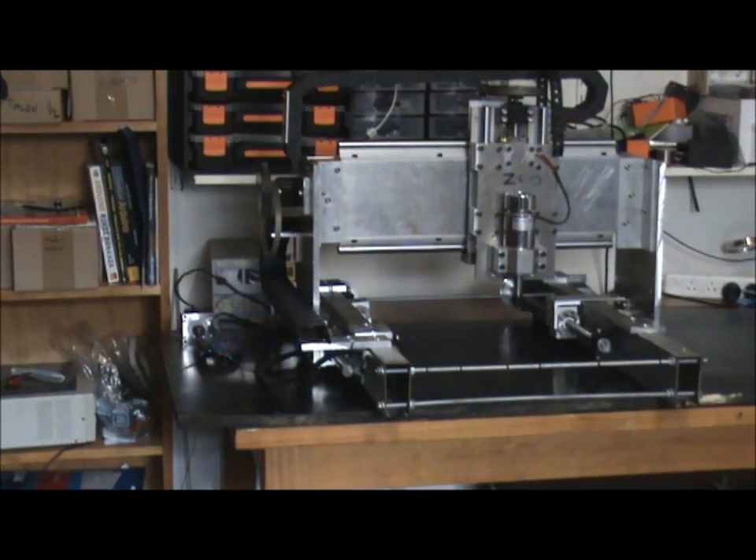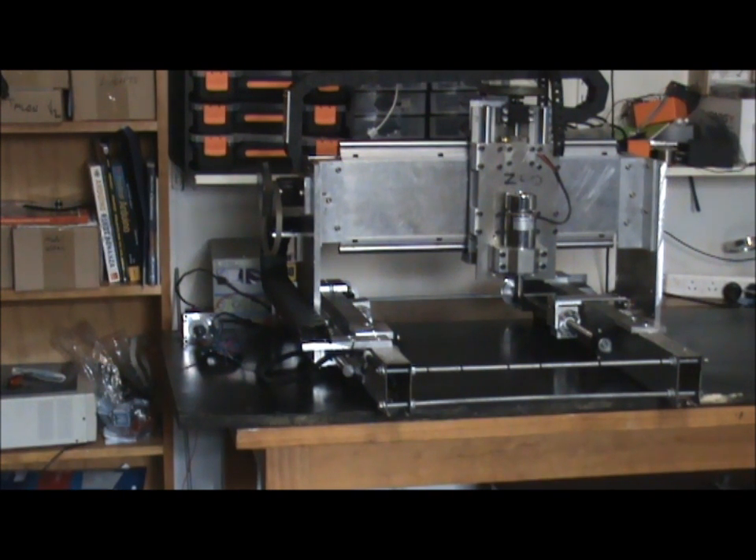On the left hand side you'll see more articulated cable trunking and an attachment bracket. Just below that you can see a 20mm fully supported linear rail. I mainly used 16mm fully supported slide bearing, but I got the 20mm really cheap so I grabbed that as well — it's a little bit heavier so I put that on the bottom.